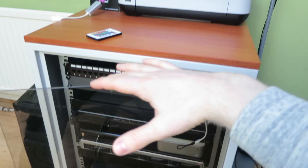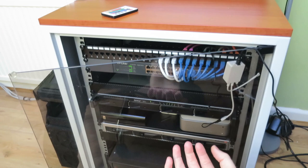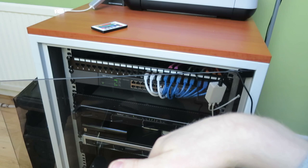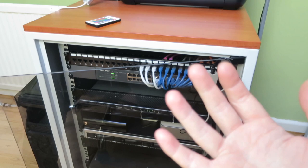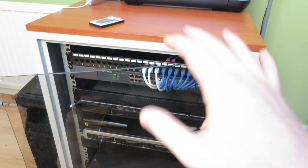So what I wanted to do was facilitate that process by adding a fan in the middle portion of the rack to add to that pressure, to carry some of the air right through to the top of the rack. So adding a vertical panel at either the front or the back wouldn't have been effective. It would have just blown air all over the place. It would have got things circulating, but it would be impossible for me to tell whether that is effective or not, because you're getting into complex science in terms of airflow and pressure and static stuff and whatnot.